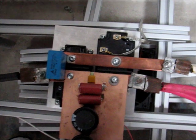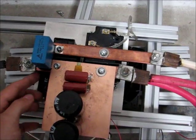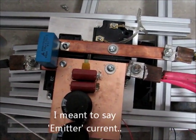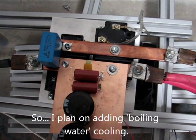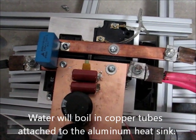I'm definitely having a problem with heating in this new controller compared to the old one. This IGBT that is doing the switching has one and a half volts across it regardless of the drain current. So if I'm pulling 200 amps, that's 300 watts. The IGBT can handle that much power dissipation, but it's got to be liquid cooled for that to happen.